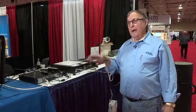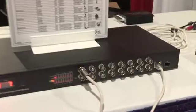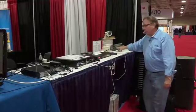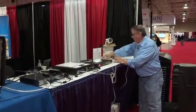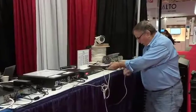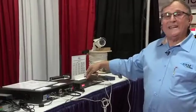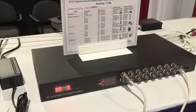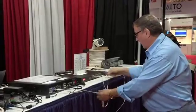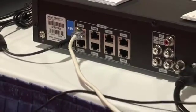Now I want to show you the hookup for IP over coax cable. There's 500 feet of RG-59 plenum with the compression connector on it. There's my IP camera — I'm coming out of the IP camera with a transmitter, Cat5 feed, and coax feed down to the cable. Coming back into this POE switch, or what I call a POC converter — a 16-channel converter. I'm coming out of here with Cat5 into the NVR, and from there it's the same as any other IP installation.